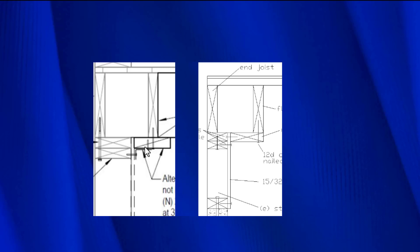These nails are only an inch and a half long, so you have to put them an inch and a half here, and then you would put one inch and a half here and you'd only get one inch of penetration, because this is half an inch thick — so it's real minimal, the amount of strength you'd get out of that. It doesn't make a whole lot of sense to me. You would normally nail the plywood up and then put in this piece of hardware. This detail does have a few problems.